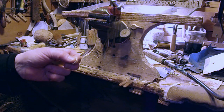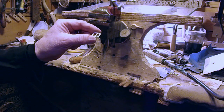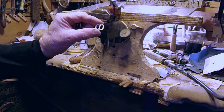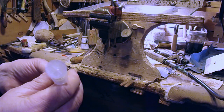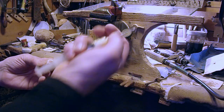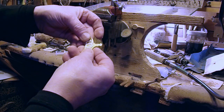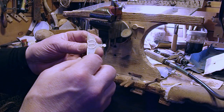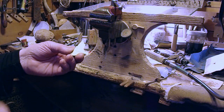Generally I have a little piece of rawhide kicking around here, which will pad the brass and keep it from getting scratched up. If you get into this sort of thing, I advise strongly making little templates of things that you make, especially things you think you might make twice. I just dug this out of my jewelry drawer and that's just the right size. I like these double-D kind of 18th century style buckles. So I put a little dab of glue on the back and apply the template. It doesn't take long to set up enough to use — all I want is for it to not move when I'm scratching in the pattern. If I remove it before the glue really sets, the template comes right off again, so I'll have it for the next one.